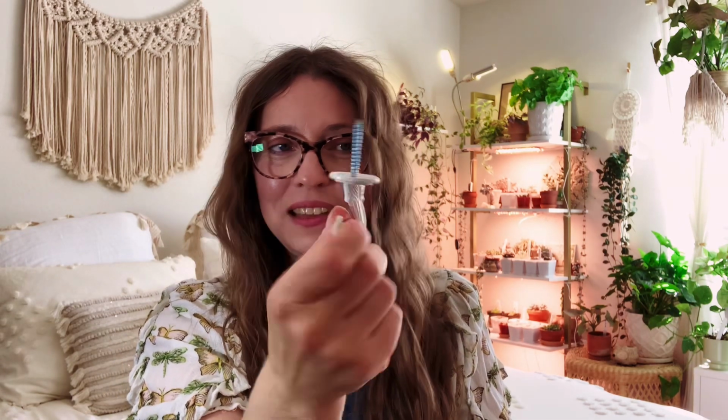So this particular hook comes with that device I showed you, and also it just comes with this piece. If you're drilling into wood, you don't need any sort of anchor. A screw in wood is going to be really secure, and you just attach these two pieces together, and then you can screw this right into, if you have a beam on your ceiling, this can go right into the wood beam. So that's kind of nice too. You have two options. If you're working with drywall, you're going to use this. And if you have wood, you're just going to use these two pieces.